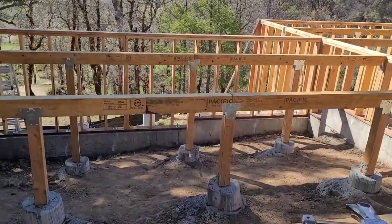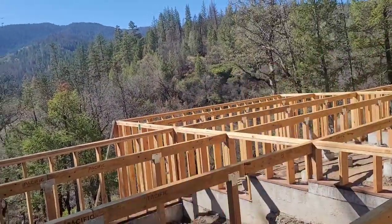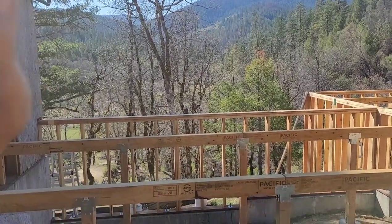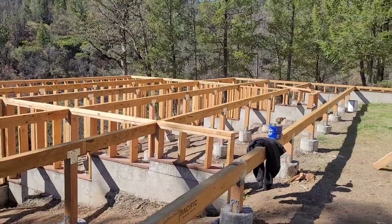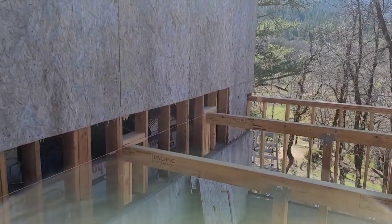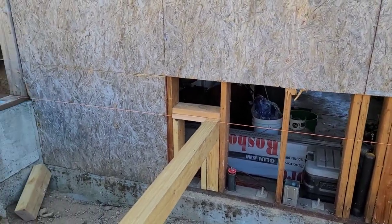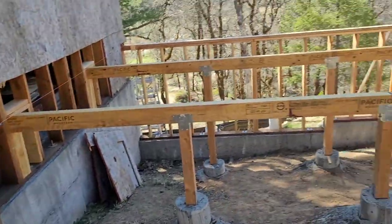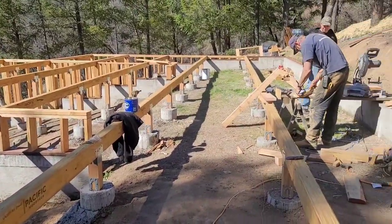Now what's left is we go across with these joists all the way across this way. And wherever there's a wall inside of the house, there's a glulam also. So that's what we've got planned for next week. Hopefully we have a full crew, because those things are heavy, and I'm not looking forward to that, but we're gonna get her done. We've got four more weekends before our first inspection, and I'm very pleased that we got to this point. This was the bare minimum I wanted to get to for us to make that inspection.